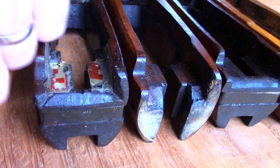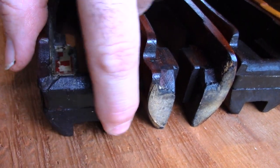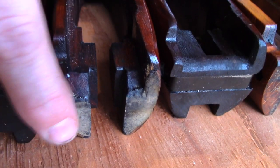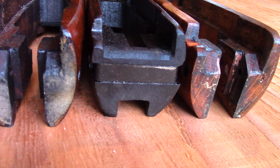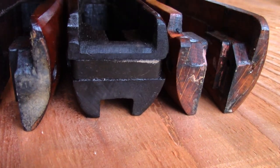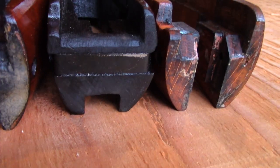You should also not have any contact up against the wrist anywhere in this area. If you do, it should just barely be touching any of these rifles. There should be no contact anywhere near. So what you can do is oil up your metal and see if you've got much in the way of contact here, or you can just paint it with something and see where it's contacting. You're just going to shave those areas down just a little bit.